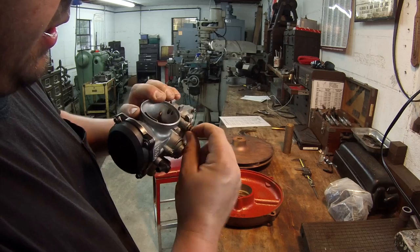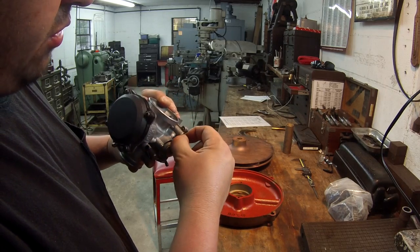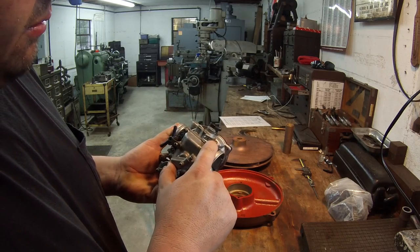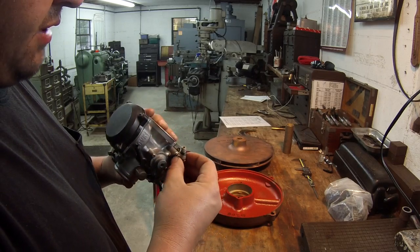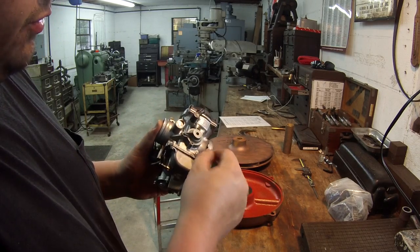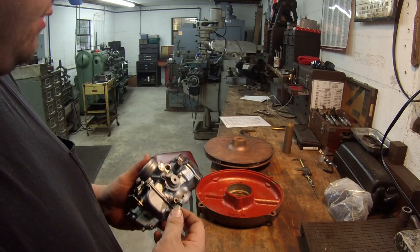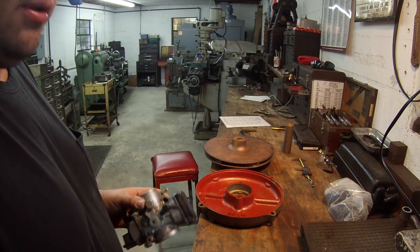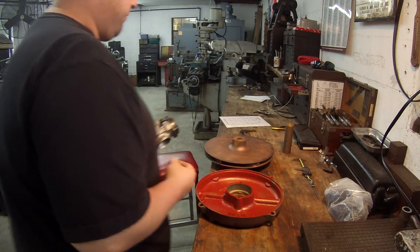There was a groove in this thing, and I found a little tiny O-ring and slipped it on. So I'm gonna attempt to allow that O-ring to do the sealing on the part that I make, and possibly have two little tiny set screws that might go in there and tighten up on this little boss here. So we'll see. So that's another little job I got to do right there. I don't know if it'll be all included in this or not, but this is what I got to work on. I thought I'd just throw it all together for you to see.